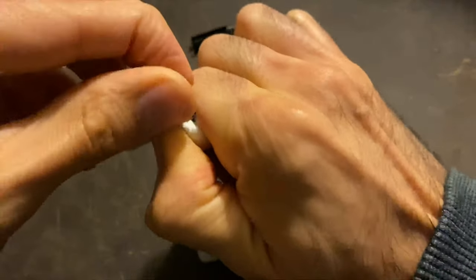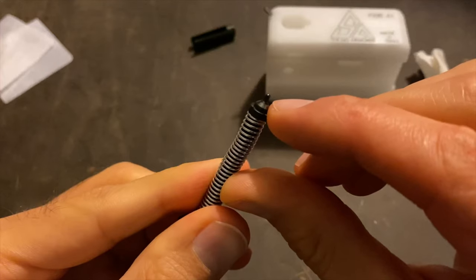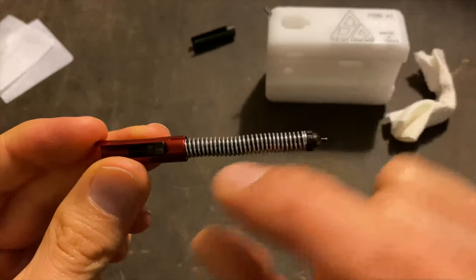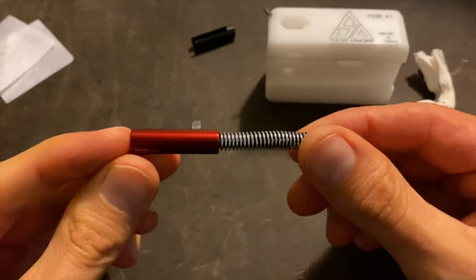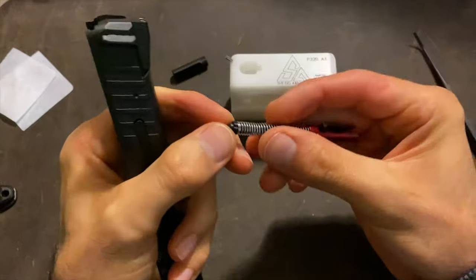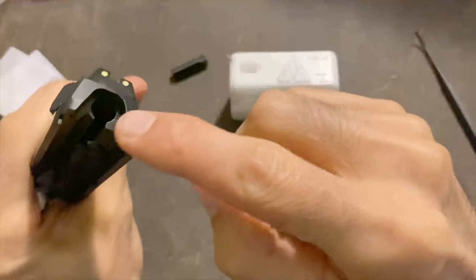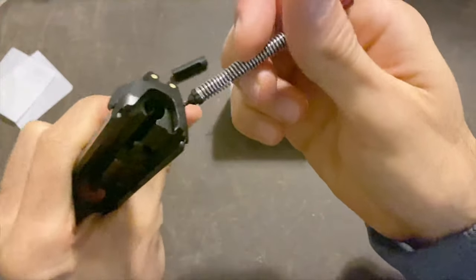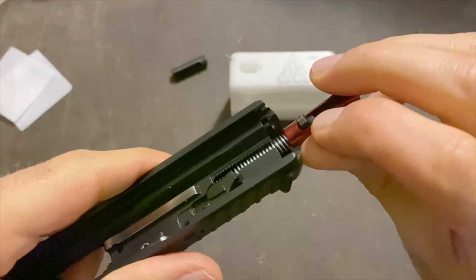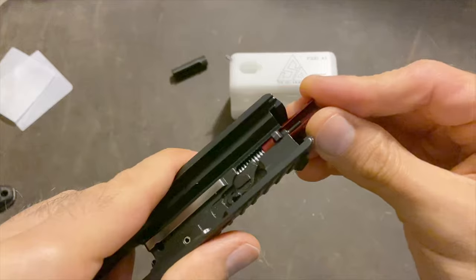Just like that. As you can see, the two cups are underneath the firing pin lip and it captures the spring between the collar and the support sleeve — this is what it's going to look like once installed. The next part is installing it to the slide: take this portion and put it into this hole right here, and it goes in just like this. This piece sticking up will go into this channel right here — it slides in.